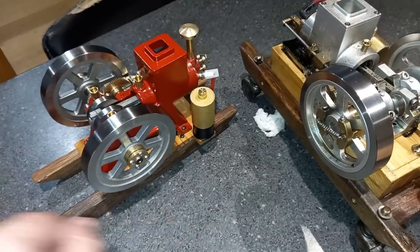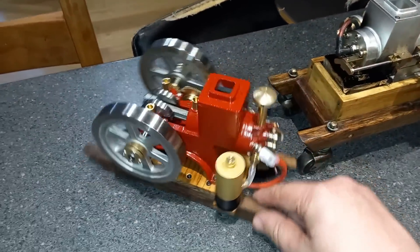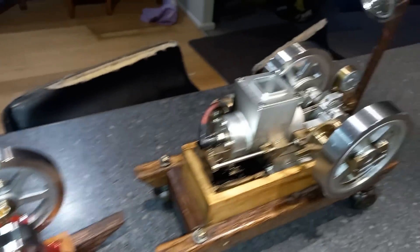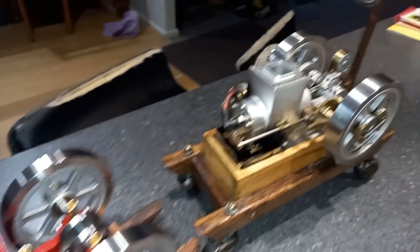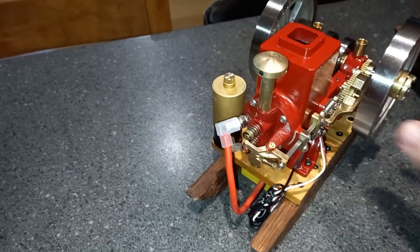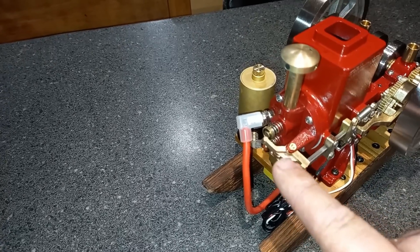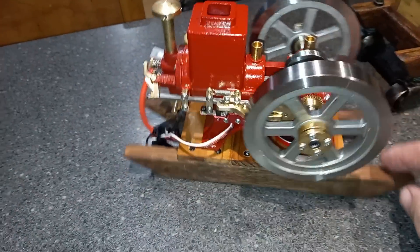In summary, if I was going to review this: best packaging of a product I've ever seen come from China, ever. Packed around the flywheel — that was not going to bend. Quality is much better than the older engine. This older one has had a lot of running and it's tight now, but I had to do a lot to fix it — it was loose and rattling, and the main bearings were just awful. This one: bearings are fantastic, the way they should be. I love the castings — we've got castings in the base, cast conrod, cast head, and cast flywheels with stainless steel rims.